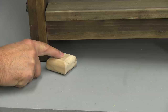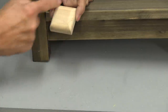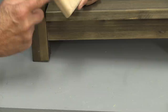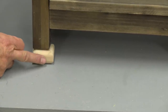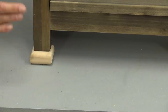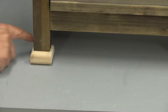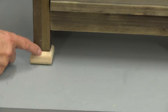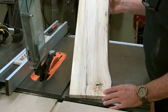While we're on leg extensions, you don't have to make large thick ones. There are companies that make little wooden project blocks — round, square, different thicknesses. You can make these yourself: it's just a small square piece of wood with a quarter round cut on the router table, takes a couple of minutes. Something like that can be used as an extension as well. Again, it's done on purpose so it stands out — in this case I would typically paint it black so it stands out a bit more. Have a look around and see what fits your project best.